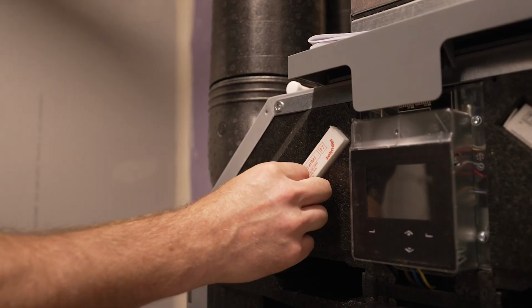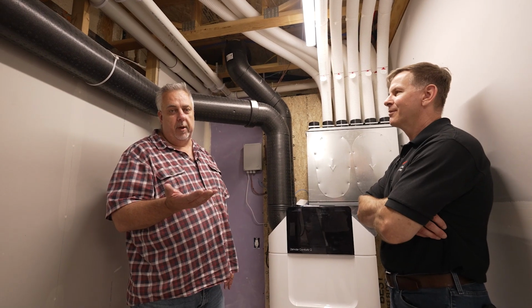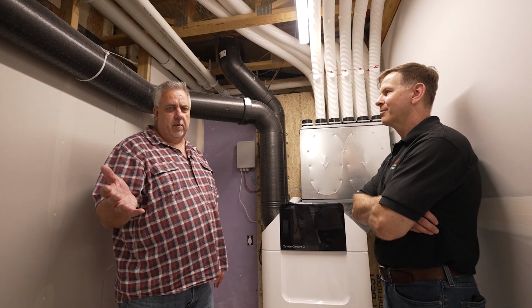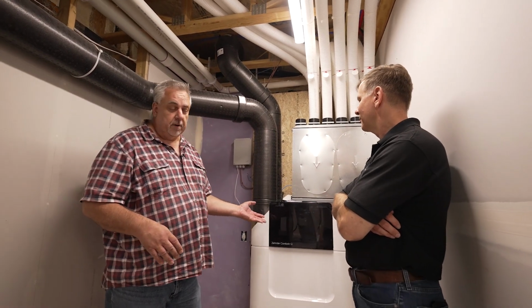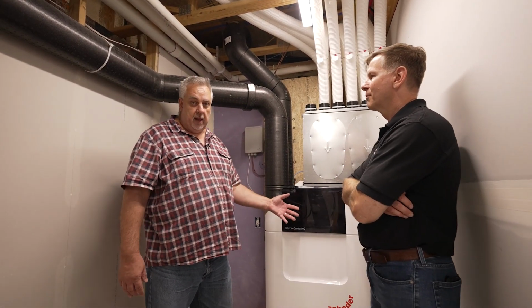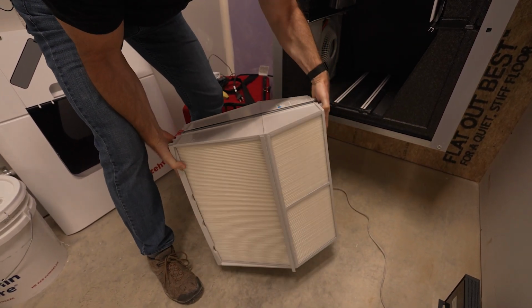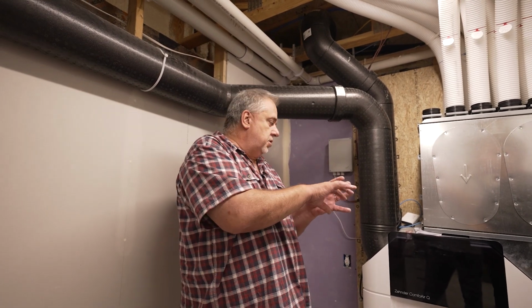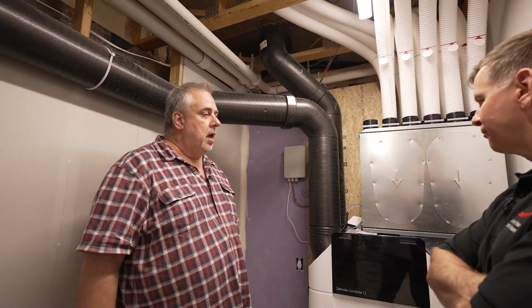For all of you that say our houses should breathe, I ask you, how does that air get filtered? Oh, through the edge of the dirty carpet, all through those nooks and crannies, through the fiberglass insulation, all those great filters that we build into our building assemblies, if you go that route. If you go this route, it comes through a MERV 15 filter, and then gets exhausted. As Chris said, there's no energy penalty, because the purpose of the enthalpy wheel is to strip the energy off the exhausting air that I've bought and paid for, and then put it on the incoming airstream. So basically, I take those dollars or pennies off of that exhausting air, and I dump it on that supply air system, and I put it in.